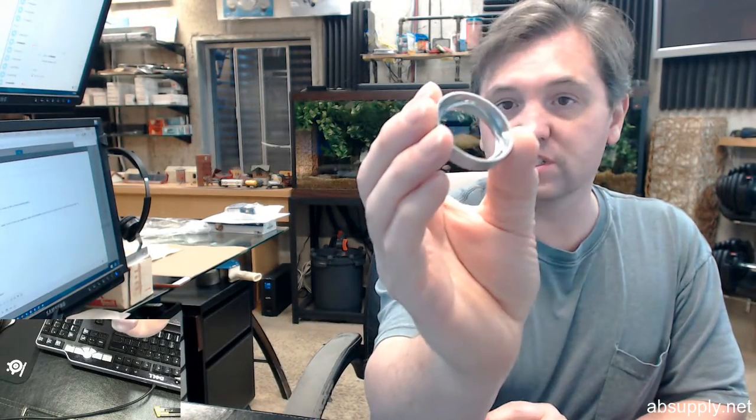I like to use this in lieu of stock thick straight cylinder collars, because you really never know exactly the proper position that you're going to have the cylinder threaded into the door. That ring, let's say you start with 1/8 of an inch, maybe it's a little bit too thick or maybe it's a little too thin, and you can't get an additional full rotation out of the cylinder before the cylinder collar stops rattling on the door or being loose. So I like these sorts of cylinder collars with the wave washer better for that purpose alone.